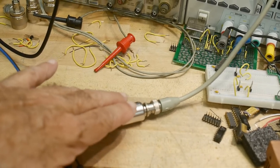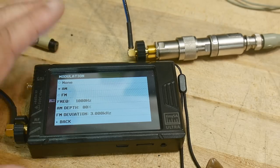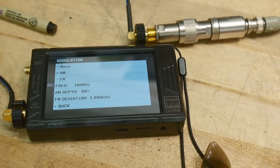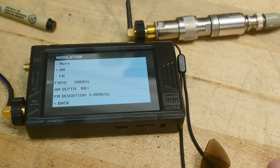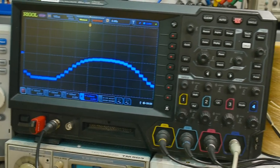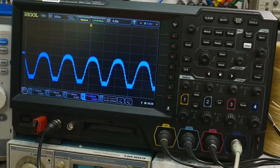So what did we learn? We can see that the source is turning on and off, and we can use this to validate that we're actually modulating and look at the modulation. What we really can't do is get absolute numbers — it's hard to use these to say you have exactly minus 20 dBm, though with charts you can probably get within five to ten percent. It was really meant for relative measurements to make sure things are working correctly. Old-timers used these constantly.